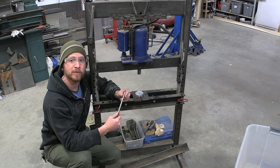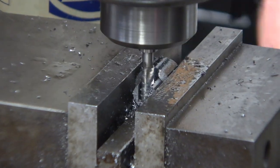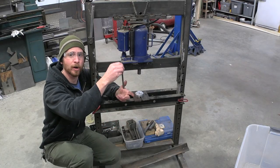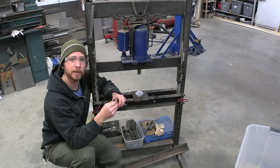I've never cut a keyway before so I had to buy a new tool. This is a keyway broach and I bought the cheapest one so it didn't come with any guides. I had to make the guide on the lathe, but that wasn't too difficult. Then you just use the press or an arbor press to run it through — it gets gradually wider as it goes and cuts a nice keyway so you can put it on the shaft.